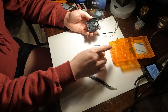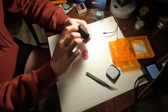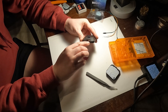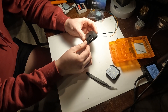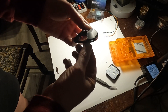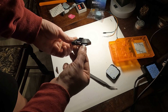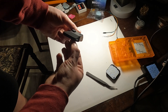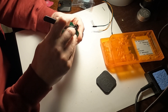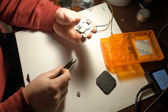Then what you're going to do is just carefully remove the GPS unit. Before I do anything else with the build, what I like to do is go back into the garage and cut the back of the shell of the GPS unit — I cut these little notches in the corners. I do this specifically so that the glue that I use has a spot to grab the shell and hold it even more tightly so it doesn't pull itself off of the Game Boy at any point.